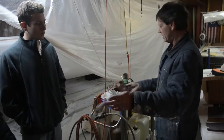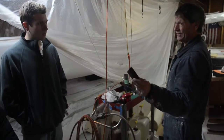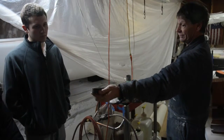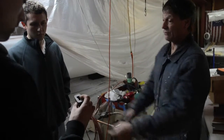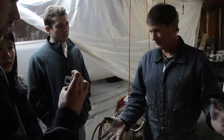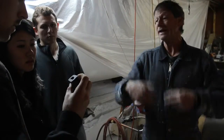And this particular one was 5 feet tall. It took 60,000 pounds to shear that thing sideways. And that's 200 layers of wrap around. Unfortunately, I used balsa as a mandrel, but it was there. So I wrapped it around there, cooked it till it was tight, and then kept wrapping.